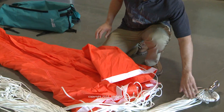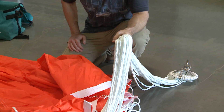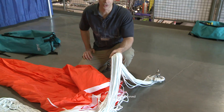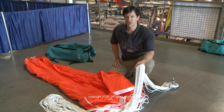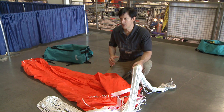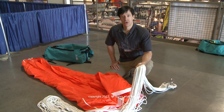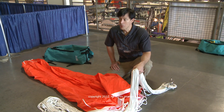Additionally, what we learned through our sea trials was that when you add a lot of shroud lines to parachute canopies, you create a better hemispherical shape — a circular shape on the parachute when it's deployed. It also makes it a lot more difficult to invert, to turn the chute inside out, because all these shroud lines create a barrier when the parachute oscillates — oscillating meaning it kind of pulsates like a jellyfish. Also, the more shroud lines you have, the more it distributes the workload, so it's not going to break as easily.